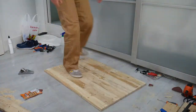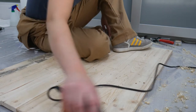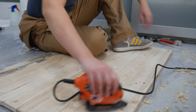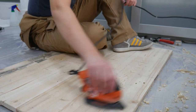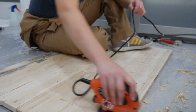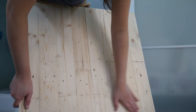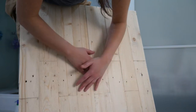Many unbearable hours later, the next morning everything was nice and dry. It was time to do some sanding to the tabletop — first with an 80 grit and then a 120 grit, which took me about an hour. But it was definitely worth it considering it looks smoother than a baby's bottom. Definitely a lot of work, but this is how recycling pallet wood goes.